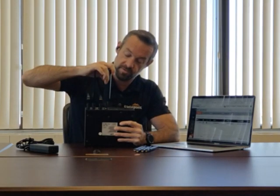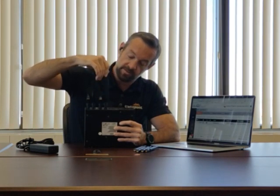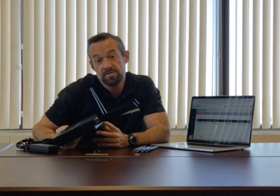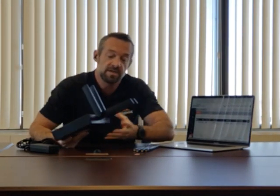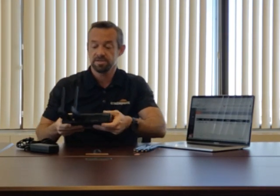There are three main antennas and the fourth one is aux. Get these guys just finger-tight. If you notice the configuration of the antennas, every other one is straight up or out to the side. That gives separation between the antennas so that the RF can be received and transmitted most efficiently. Those are our cellular antennas.